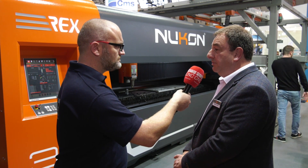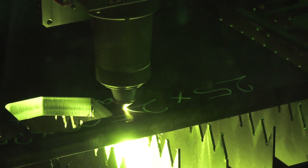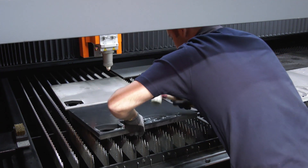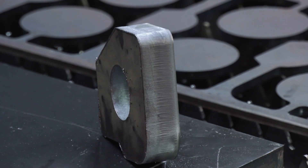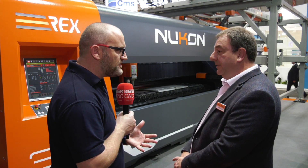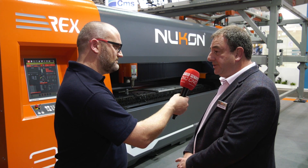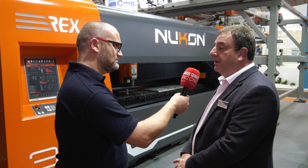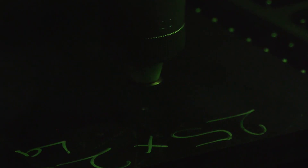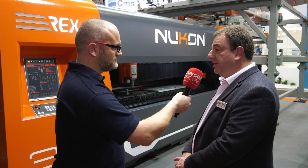Most units are 100 microns. So where's the benefit — is it correct to say you can go lower kilowatt for thicker material? Two kilowatt will cut up to 15mm mould steel, and this 6kW machine will cut 25mm aluminium, stainless and mould steel. The big advantage of less kilowatt is less power consumption — most customers buy a larger kilowatt machine for faster operation, but 2kW is an ideal starter for cutting up to 15-16mm mould steel without any problems.